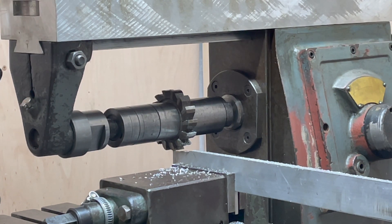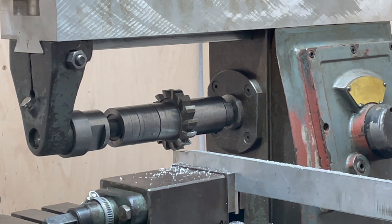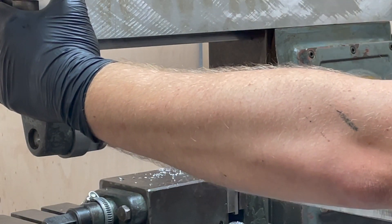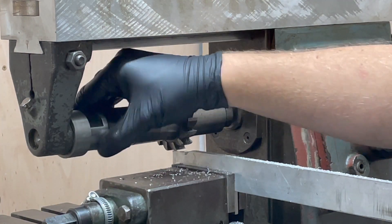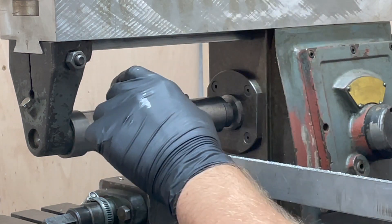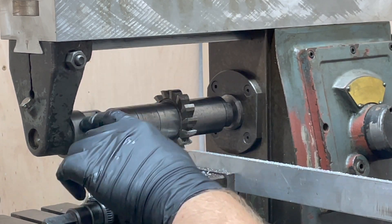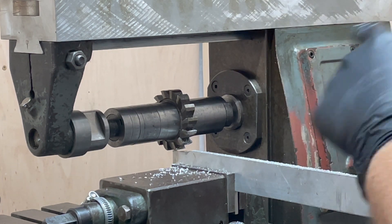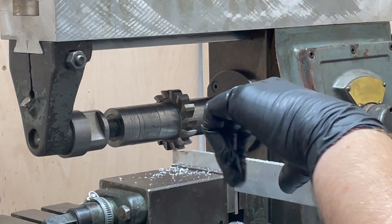Okay, didn't like what happened there, so definitely going to have to figure that one out. The locking nut on the arbor had caught against the inside of the support, so maybe I need to cut the other direction — in reverse — so that the pressure is the other way and it will be locking it tighter.